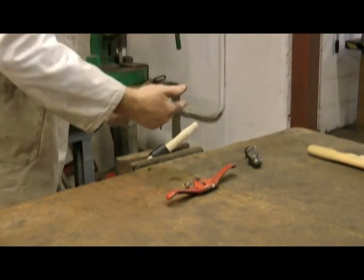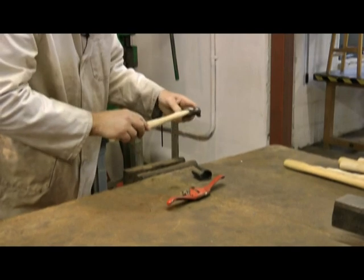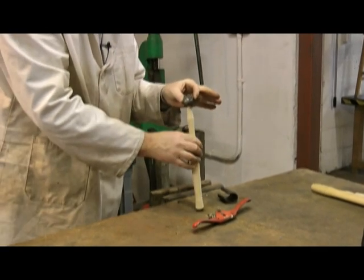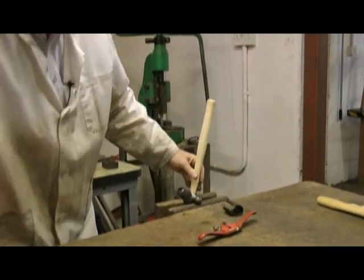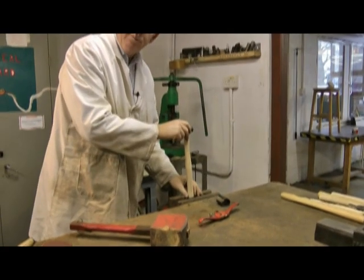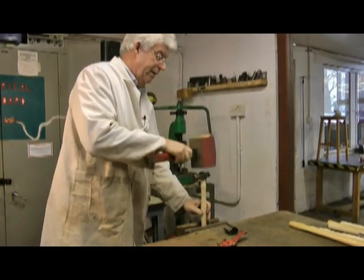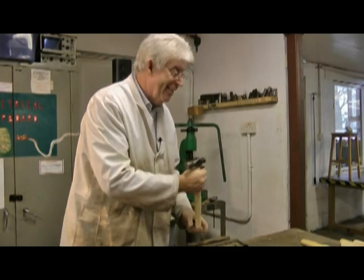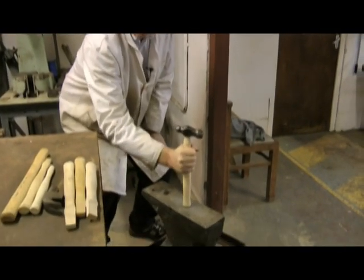I've just taken a little bit off all round, now I'm going to take it out of the vise and try it. At this point we need to apply a little bit of force to get it down, and there are different ways of doing this. Some people like to put it over a vise and hit it with a mallet. Others will put it inside the vise using a piece of wood to protect the bottom of the handle. Personally I prefer the shock tactics by hitting it on a firm surface such as an anvil - a firm tap and it will move itself down onto the shaft.